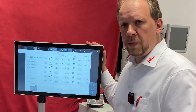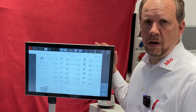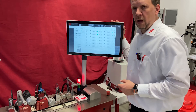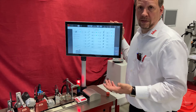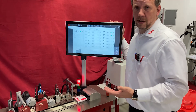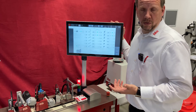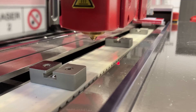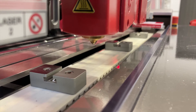On our simulator we have an HMI that drives our melter to set up the temperatures on the gun and hoses, and also controls classical applicators like pneumatic or our Tesla Evo gun, which can connect to a classic PLC. The PLC drives a classical line application.